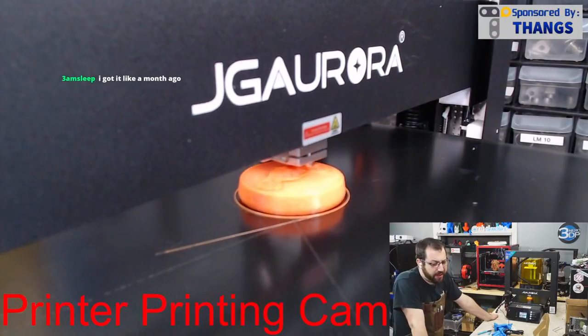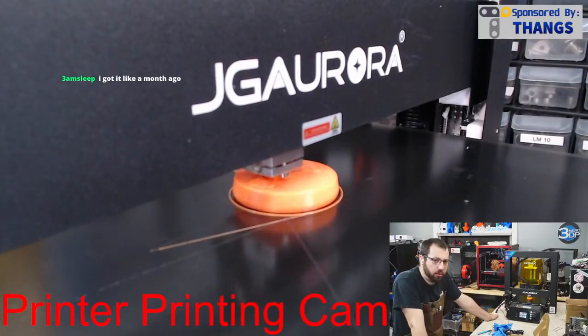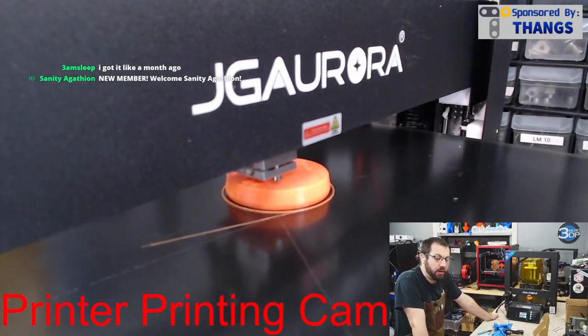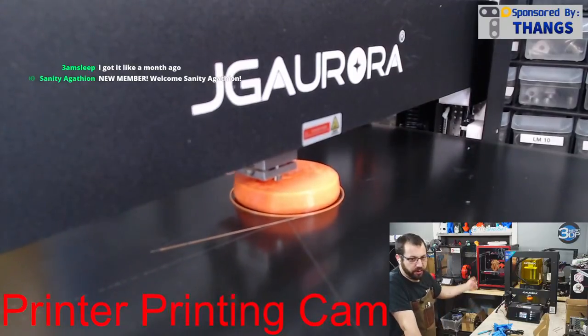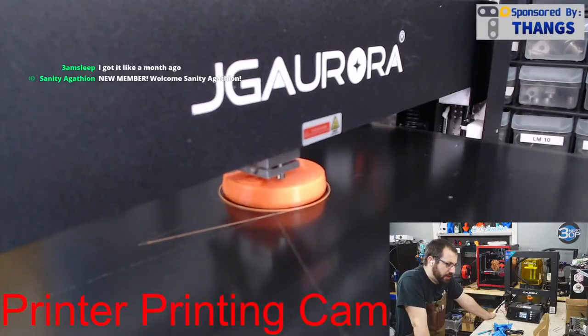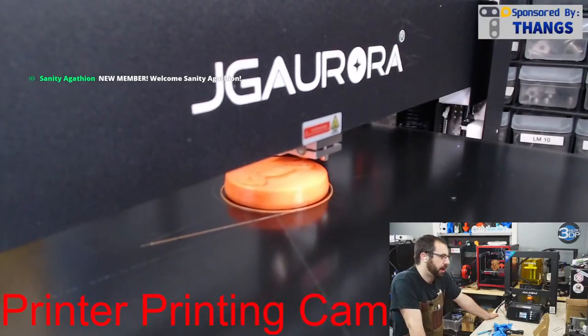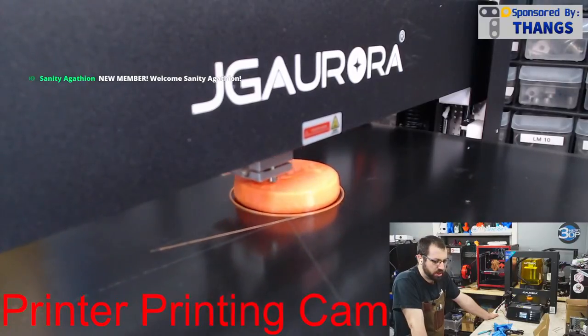Yeah, PETG is flexible. So my original V1.0, or V1.5, Tallboy was originally a V1. I originally printed in PETG, and then I reprinted the whole thing in ABS, and after swapping ABS parts, the parts were cleaner. I had less ringing, and the parts were just cleaner.